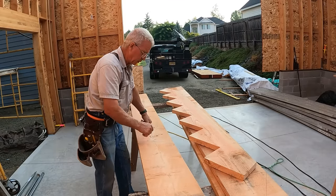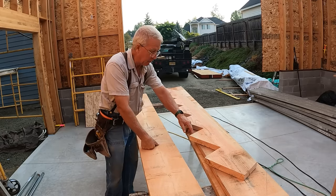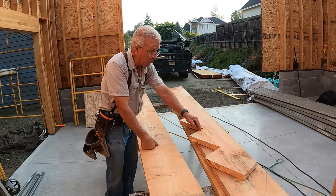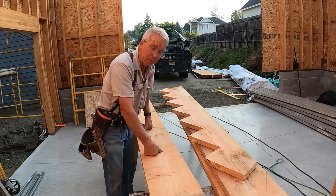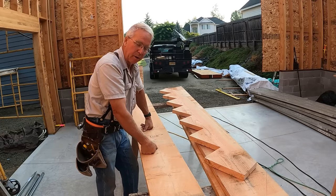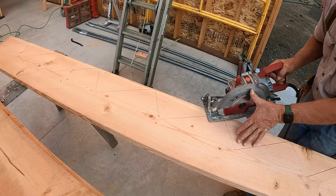The heart center in this one is exactly at the apex, at the intersection of the horizontal and vertical faces. It's either that, or if I flip the pattern over, it happens with about two-thirds of the nose up in the air where it could break off. So I'm going to roll the dice and run this heart center right down that intersection, and we'll see what happens. I don't like it, but sometimes you just got to swallow hard and keep moving.